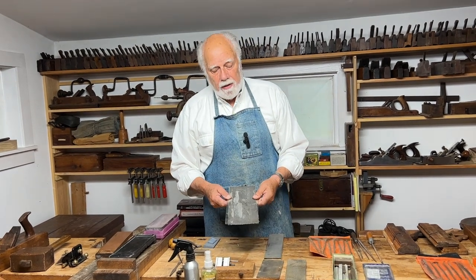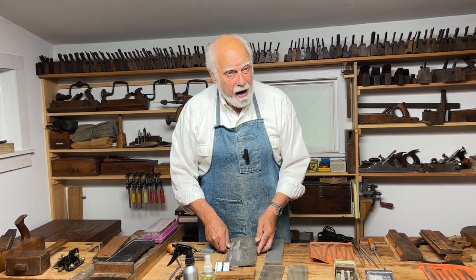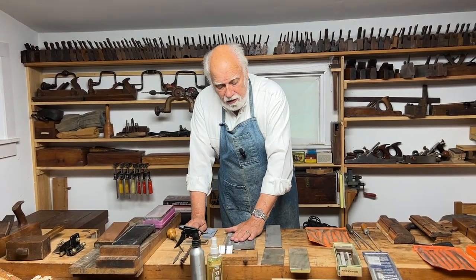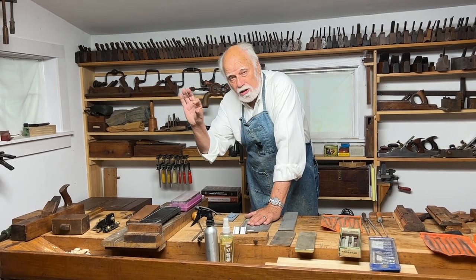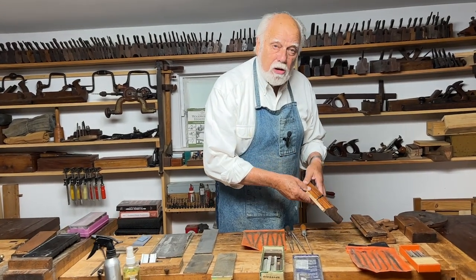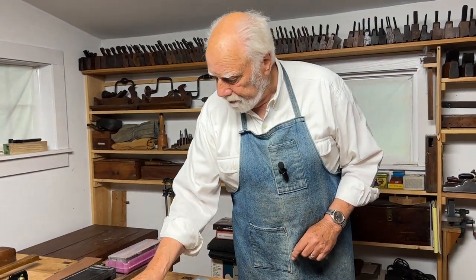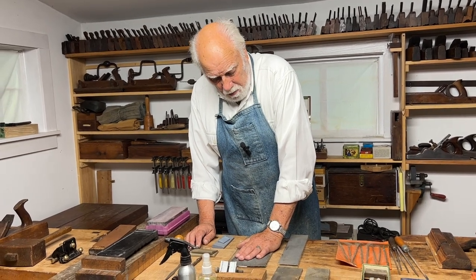Here's a really basic way of doing it: a piece of plate glass, to which you can affix different grades of wet or dry paper. That also works primarily because the plate glass is flat. And one of the most important things about sharpening, whether you're sharpening a straight square blade or a curved blade as I'm going to show you in a bit, is that you don't always need to be perfectly flat — sometimes you have to take into account the fact that things are curved.